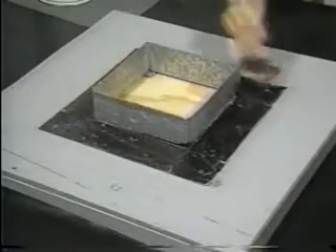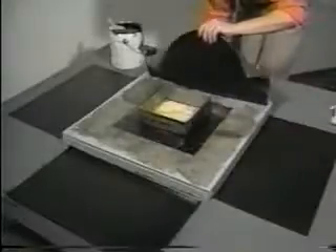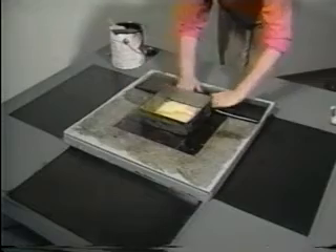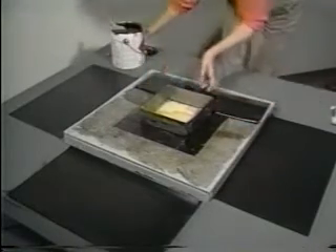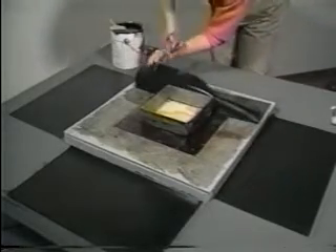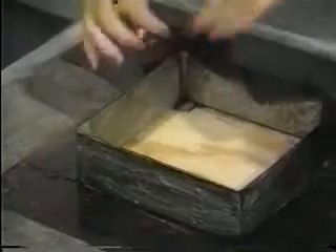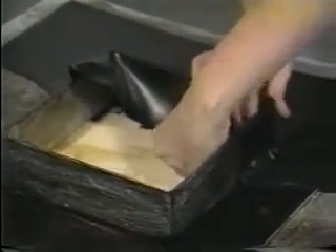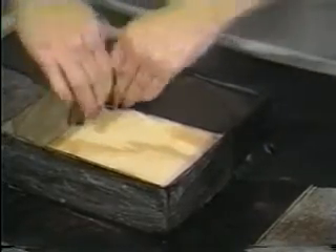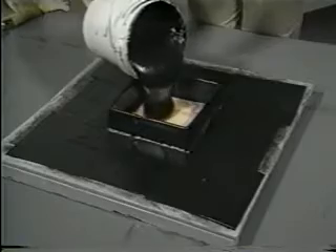Tack the edge and apply the adhesive. When the glue is tacky, roll the rubber to the edge and then up the sides. Trim the sides around the corners using a curving cut to a 2-inch minimum width. Push the sides and top edge down. Do the other sides exactly the same way, starting with the opposite side, then do the other two sides. Roll all flashings and caulk. The finished pitch pocket should be filled with international pourable sealer.